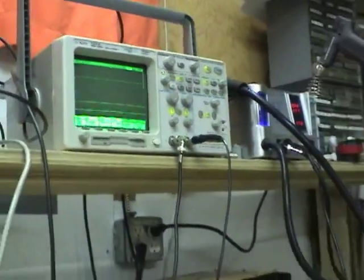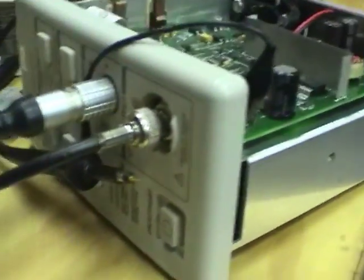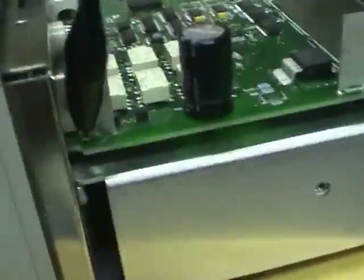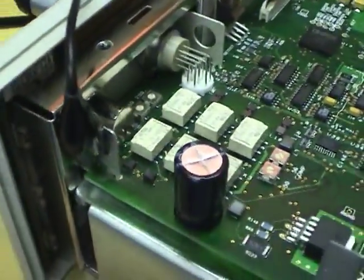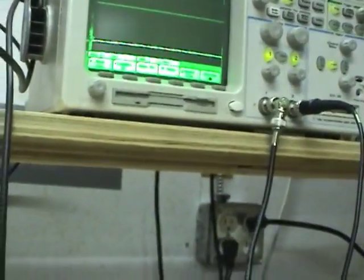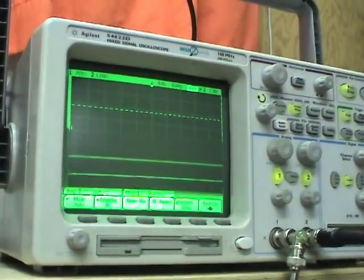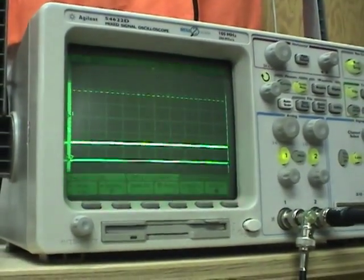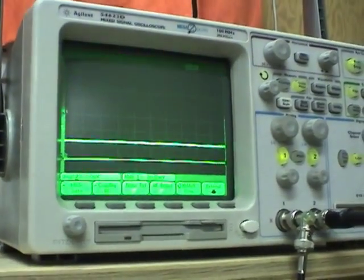And I also looked up when the probe starts flashing those 2 LEDs, that actually means an error code, and these four LEDs here indicate what the error code is, and this one, binary 2, means that there was a problem zeroing the DC offset. And when we're on the AC coupling range, the offset is off. It's quite a bit negative for some reason, so that might be what's causing the problem.